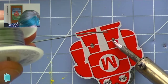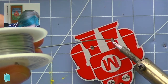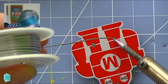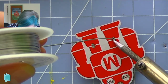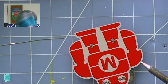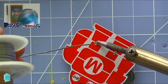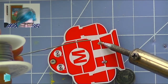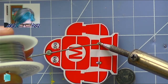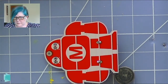This takes a little time, especially since I just warmed it up. If I had a variable temperature soldering iron I would probably bring the temperature down just a bit here. I'm not as close up as I normally would be because I'm trying to film it — which is a whole new challenge. There we go — we've got one knee. Coming over here to heat this one. A helping hand can be very, very useful for moments like this, or sometimes just a literal helping hand — a friend to hold it in place. There we go — two little knees soldered into place.